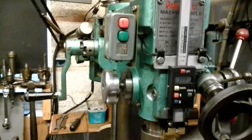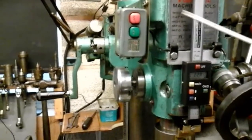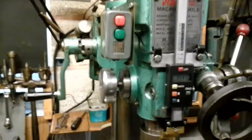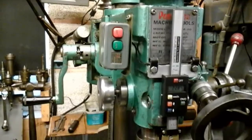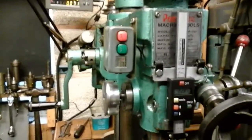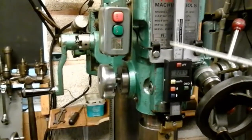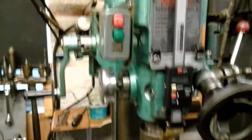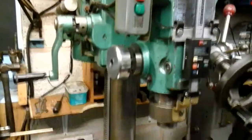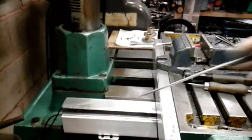So what I've been doing, I've been upgrading the machine a bit. In my last video I asked if anybody had heard of the name of this machine — it's a Peerless Machine Tools — and I can't find any information on it. If anybody can help me on that, I'd appreciate it. In my last video I showed you how I fitted this complete DRO system to it, where I hadn't done the Z axis. Well, I've now fitted the Z axis, as you can see here, and I've got everything working. I've also shown how I recycled aluminium to make some guards for the X and Y axis.